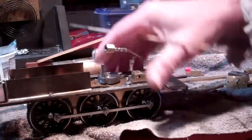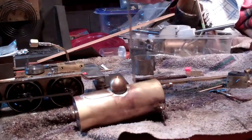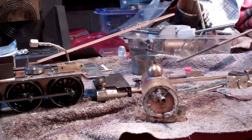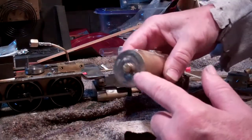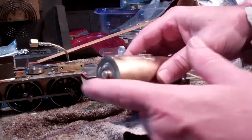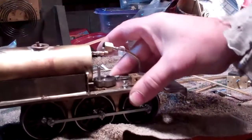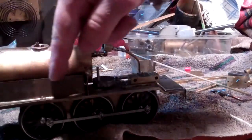The next thing I did is I built this boiler. It's a solid piece that I machined — I bored out the inside and silver soldered it with a higher silver content solder than standard 60/40 lead. I have the fill here and also the steam intake, which helps in filling the boiler up. It seems to work best if you fill it about halfway. I've also silver brazed this shield on here, which fits on and helps contain the flame from the burner, and some of the hot gases can escape out the side of this flange here.